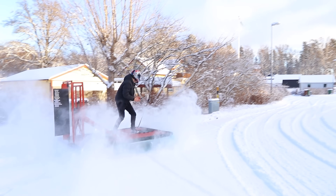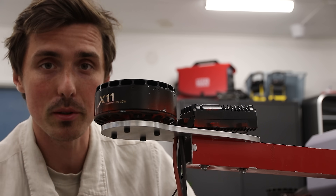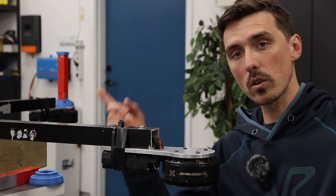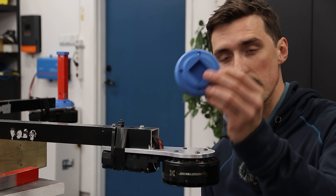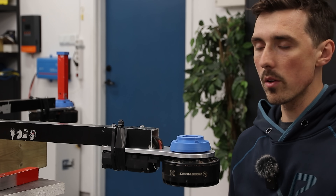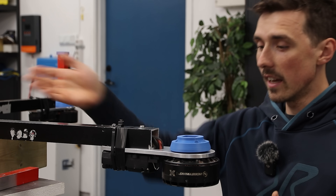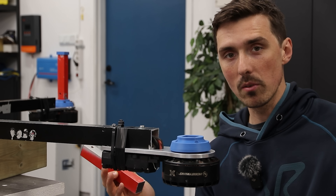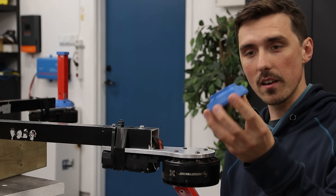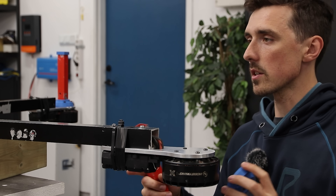I used the X11 motors from the hovercraft for the Morse gravity apparatus and they still work — they've been through hell and back but they still work, so thumbs up. Landing gear — turns out it's a little trickier than I think, because I have done several iterations at this point. They consist of a 3D printed solid part that fits right underneath the motor, and that's really the key. The previous iterations I moved around all over the drone and that turned out to be a mistake. When you crash, the propeller is the first thing to hit the ground, so the landing gear needs to be right beneath the motor or further out. I'm also a little concerned about prop wash hitting the landing gear, so I don't want anything sticking out. The idea for this part is to make kind of a sandwich: you take the plastic, aluminium, and the motor and you screw them all together. I couldn't do that on some of the screws because I stripped them.